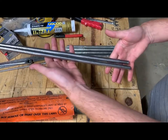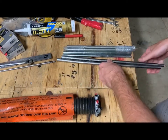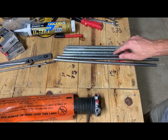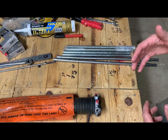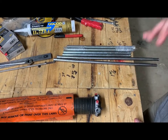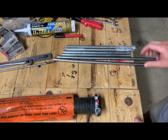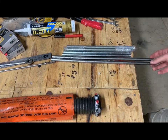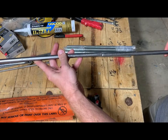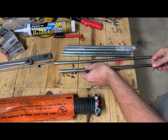My personal bars I've had for about two to three years — you can see they're longer, so I can get more torque and leverage. The shorter ones will still work; you just have to put more effort in. If you're going to a wire that's 250 or higher, it's going to be pretty exhausting, especially with higher IPPT, which I'll explain later. If you can't get winding bars from your local distribution center, you can get cold-rolled steel bar from Home Depot itself and grind it in half, bellying the edge a little bit.